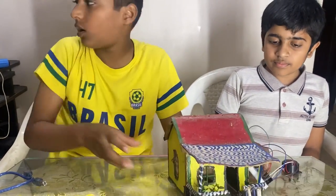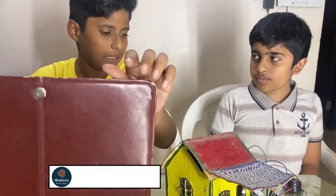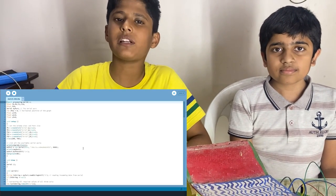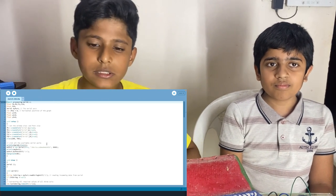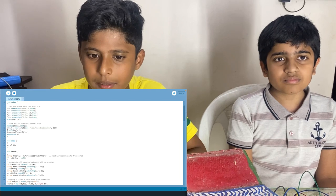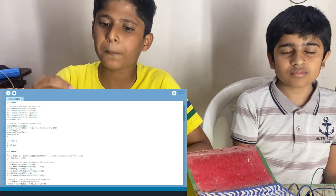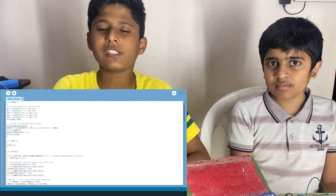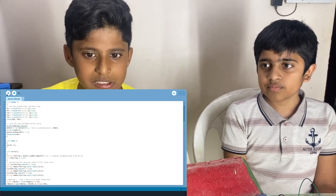For checking the readings of the X axis, Y axis, and Z axis, let's connect the Arduino. Let us open the Processing code — in the description I will give the code and the download link for the Processing app. Copy the code and paste it in the app. In the 20th line there is an option: my port equals new serial. In that we need to mention the port name of the Arduino. On a Mac it shows a different port name, but on Windows it shows COM2 or COM3 — it differs depending on the Arduino you have.